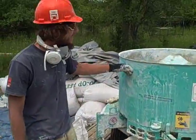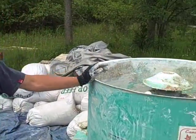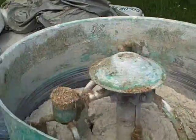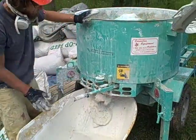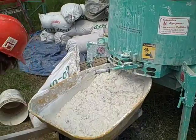What's up Mr. McLaughlin, tell me something about this. Now by the mixer we've got about half the hemp that we need in the mix to go in the actual wall. If we put any more in now it'll just gum up and won't come out, so the next step we'll be using the rototiller to get the last bit of hemp in.